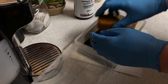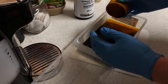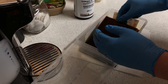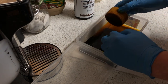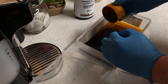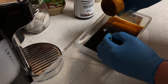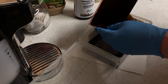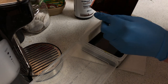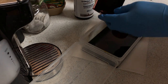It's already started eating the copper off - there's still a bit of a shimmer so there's still a way to go, but it's coming off quite quickly. The key is to stop as soon as most of the copper is off, then give it a wash down - you don't want to start attacking underneath the protected areas. The idea with the sponge was that you could wipe it lightly to help clear areas that had already been etched, but I'm very wary of doing that this time in case I lift the tracks. Let's see how we're doing.